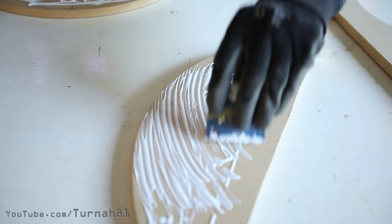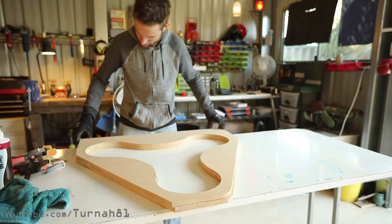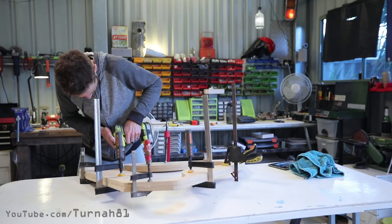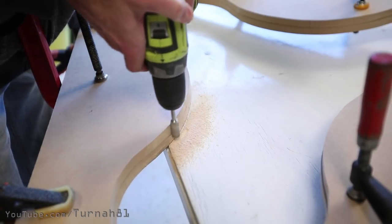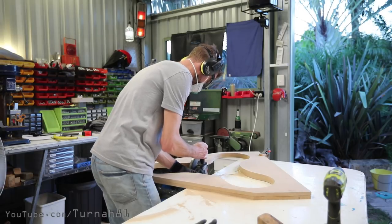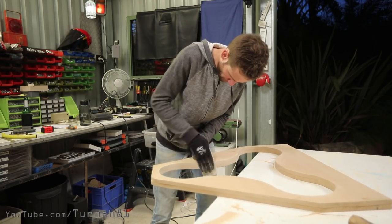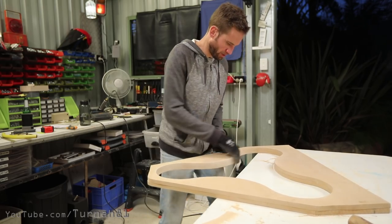Either way I'm lining them up and I'm going to glue them together with some PVA glue, spreading it out as evenly as I can so no concrete leaks between the two boards. Drop them together like a cool woodworking dude and you've got a little bit of time to line them up. Now while I'm waiting for the glue to dry, it's time to go to work on smoothing out the edges of my mold. I'm using a rotary burr — I love these things — but this job is taking too long, so I'm going to go with the angle grinder with the flap wheel, because one must always grind some stuff. And then there's lots of sanding — I've moved through three grades of sandpaper to try and get the edge as smooth as possible so it releases from the mold.